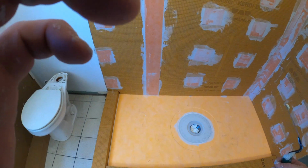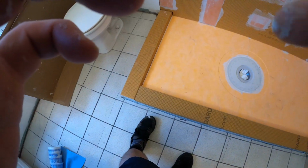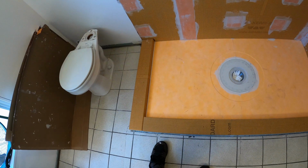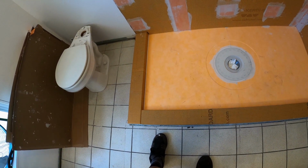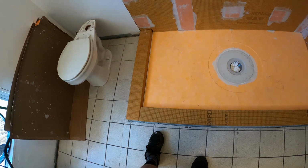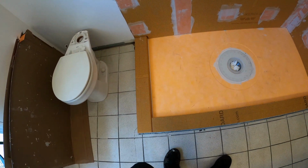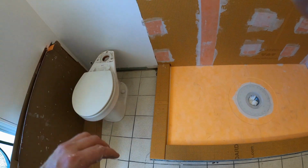We'll just treat this one kind of like a roof, bottom up. The only part that's really tricky is this corner and some stuff on the edges. So we may have to trim the pre-made pieces because the rule is 2 inches overlap. Now that we only have a 2-inch curb, we need to go up 2, down 2. There's going to be quite a bit of buildup in that corner with them overlapping like that. It won't be too bad. I think it's just what it's going to be like.